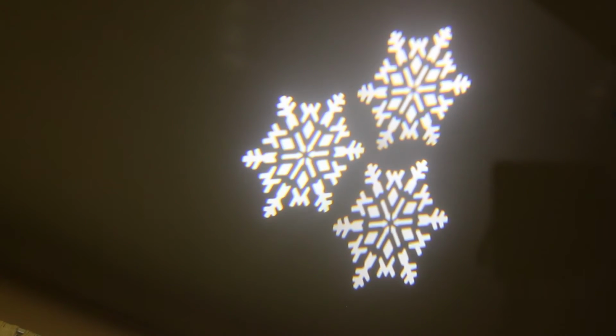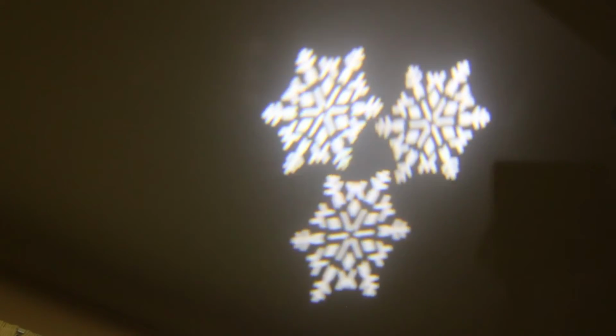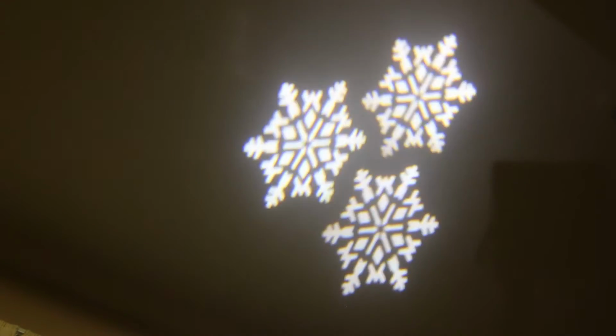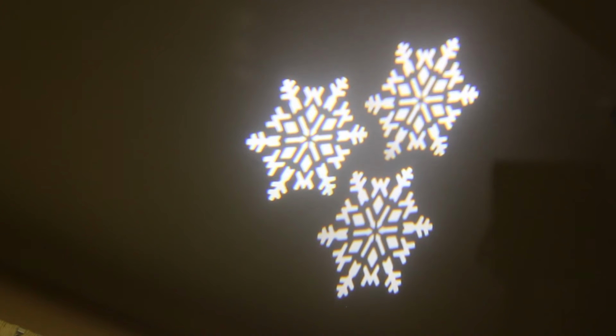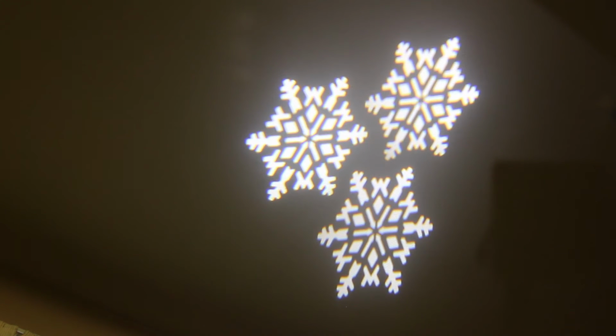The ninth channel selects the speed at which the prism rotates. At the bottom it stands still. Just a little bit above it, it moves extremely fast. And as you move to the top, it starts slowing down until it reaches equilibrium, and then it will start moving backwards until you push your fader to the exact top. So channel 10 is focus. Unfortunately, the moving head is about 2 meters away from the ceiling, so it isn't focusing at all.